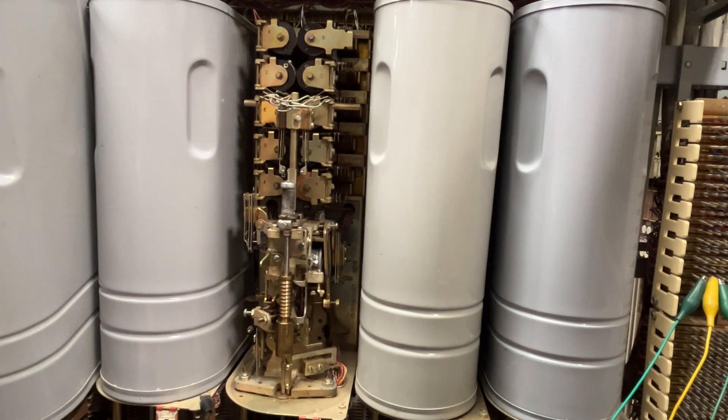If there were up to 10 lines in this, it would hunt all the way across to all 10 lines. In order to do this, there are jumpers that have to be added on the bank block or at the mainframe. In my case, I ran two 100-pair cables to the mainframe, so the hunting function is strapped at the mainframe, and I will show that later in the video.